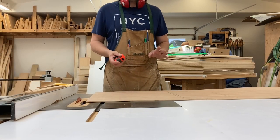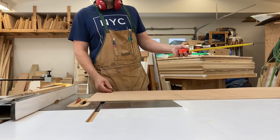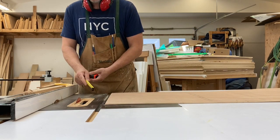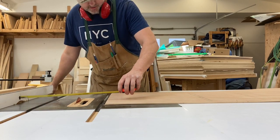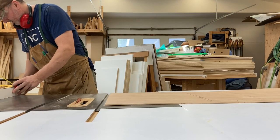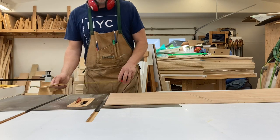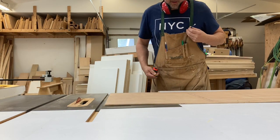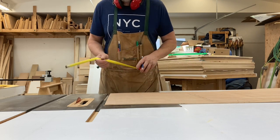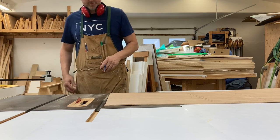I may not actually show this in my video, but if I do, I'm going to keep this same end against the fence because this other side is way too long. My first cut is from the fence to this side of the blade — it will also be the regular reading on your fence gauge — so we're going to go 18 and 7 sixteenths. My second one is going to be 29 and a half, but including the blade, because I want to leave it in on the other side of the blade — 29 and a half to this side of the blade.